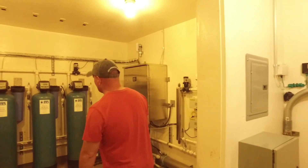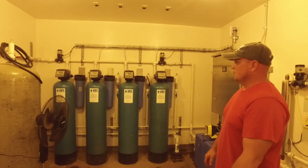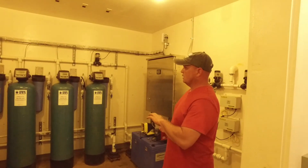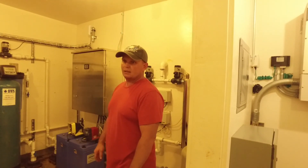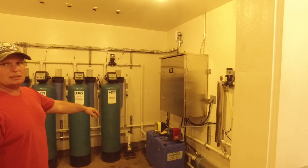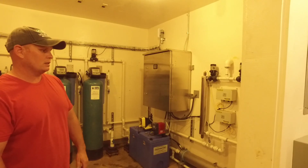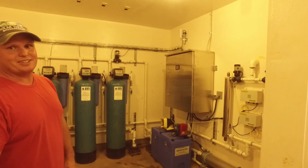Over in this other room they've also done some upgrades. This is all done by a water service company out of California, and it's a pretty high-end water room. They've upgraded it and now have a PLC — a programmable logic controller — which is able to modify and add the chemicals needed to keep this water safe. They get all their water from a spring, so getting rid of bacteria is key. They have a whole filtration system that cleans everything, backwashes it, and adds any chemicals needed to break down bacteria, plus a full UV filtration system for that last layer of defense for water quality.